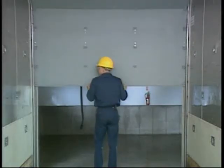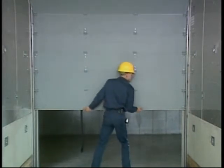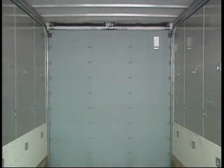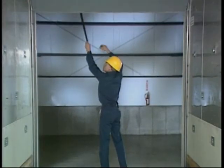Check the amount of side shift movement in the door. There should be no more than 3/8 inch total. You can adjust this movement by adding or removing spacer washers located on the rollers at the first panel joint from the top and bottom. These washers serve to center the door within the door opening and play an important role in smooth door operation.